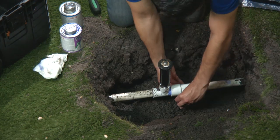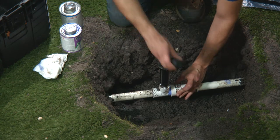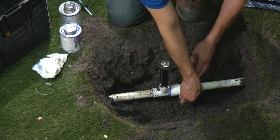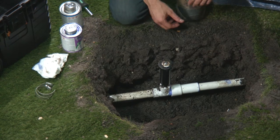If you think you need to, you may attach hose clamps to the kit to hold it until the PVC cement has completely cured — but do remove the clamps afterwards. Make sure to use fresh PVC cement. Once it's starting to thicken, you really don't want to use it. It won't hold well. I've seen it happen. Just pick up a new can.